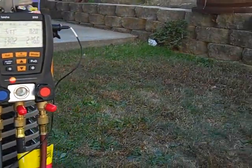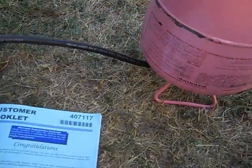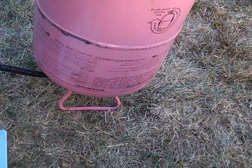So there's the chart — 80 degree outdoor temp and we've got a 130 suction and a 51 degree line. If we follow this chart from 80 over to 130, it should be a 51 degree line. So it's perfect without doing anything to it. I just hooked up my tank just in case — I didn't even get my scale out yet because I didn't know if I was going to have to add any. I'm not.